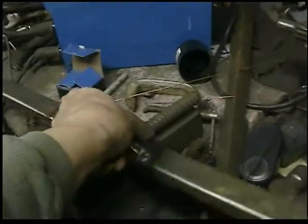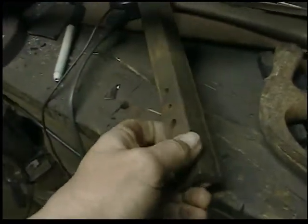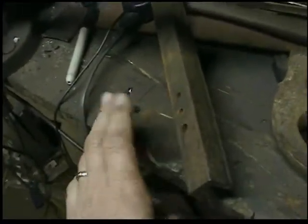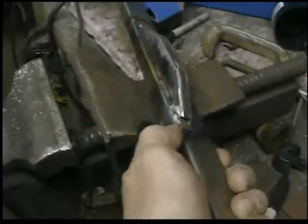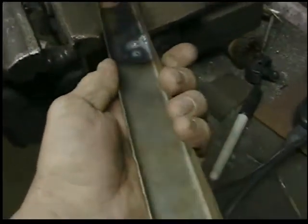It's just a piece of sheet metal — that's all it is. So rather than spend $90 I decided to make one, and there it is. What I did was I took a piece of sheet metal, clamped it against a piece of angle iron, put the sheet metal against the angle iron, and you put another piece of metal over it so it's sandwiched between the angle iron and the other metal. You clamp it, then you hit it with a hammer and you bend it — you use it like a brake. That's how I got this piece here bent over, and then I did the same thing on the other side.